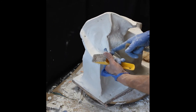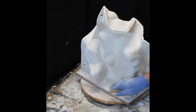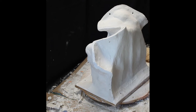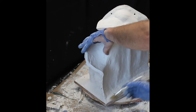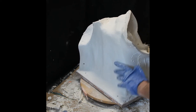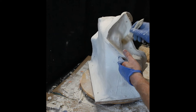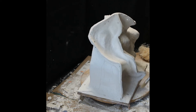When you run the quarter-inch drill bit through, run it through at an angle so you can get the bolt through — if you drill it straight you won't be able to spin a wing nut or feed the bolt in. Keep that in mind. Also make sure you wear a mask when sanding — I don't know if this plaster is silica-free, and you don't want silica particles in your lungs. Long-term exposure to silica can cause chronic lung disease — something you're not bouncing back from.